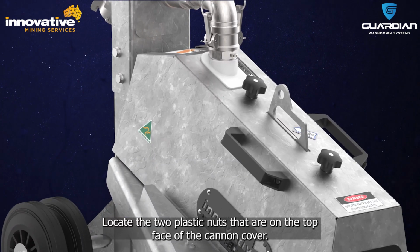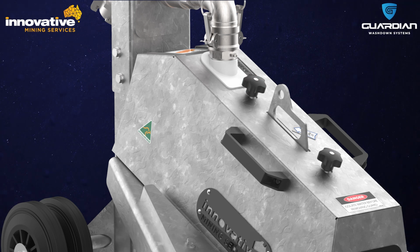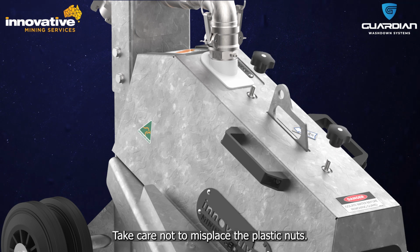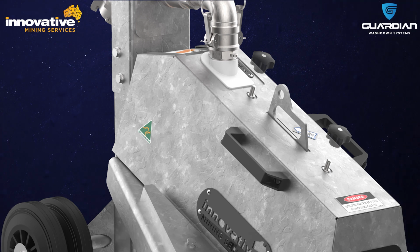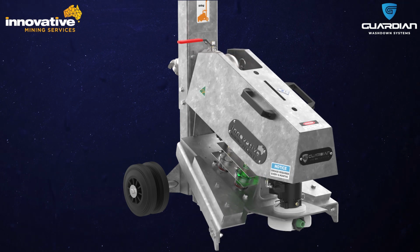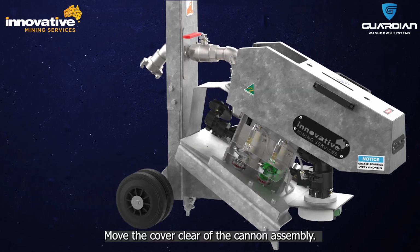Locate the two plastic nuts that are on the top face of the cannon cover. Using your hand, grip the plastic nuts and unscrew each one. Take care not to misplace the plastic nuts. Lift the cover gently until it is clear of the cannon lifting point. Move the cover clear of the cannon assembly.